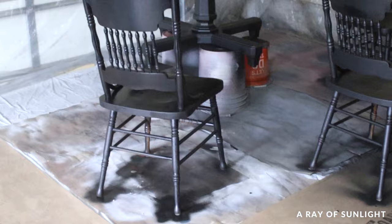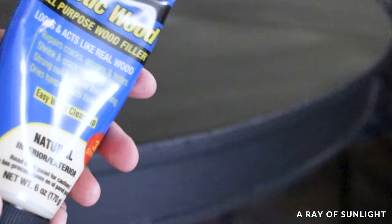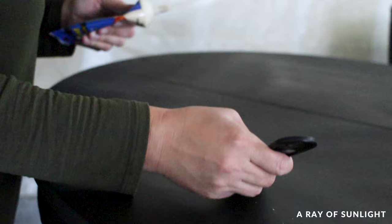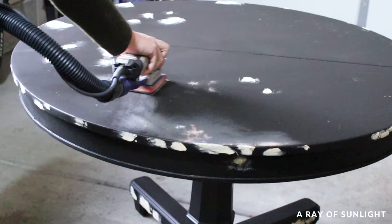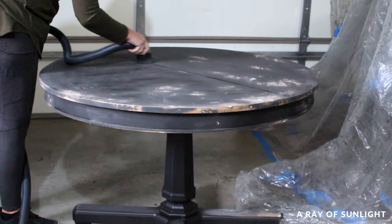After the primer dried — about an hour later — they didn't look half bad. But up close you could spot a bunch of scratches and dings, so I took the chance to fill those in with some plastic wood filler. I wouldn't use it for big gouges, but for tiny holes and scratches it works like a charm. I filled them up, let the wood filler dry for a few hours, then smoothed everything down with 220-grit sandpaper. Then I gave everything a light sanding to make it feel super smooth. After cleaning up the dust, I sprayed another coat to cover up the wood filler.